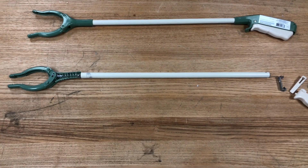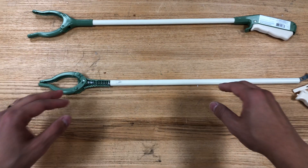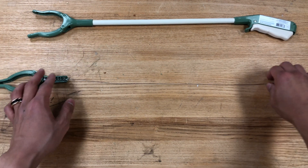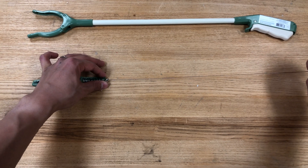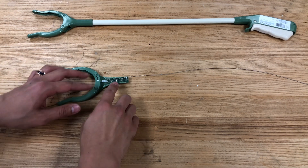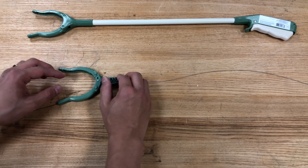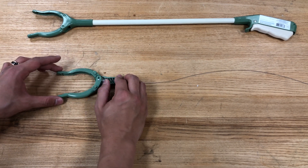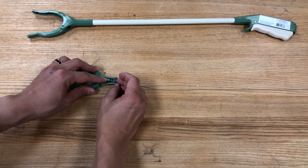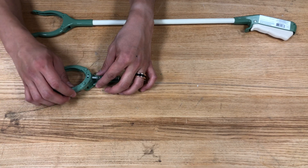I tried to restore as much as I could after disassembling and dissecting it. So inside the pipe, what it really is, is a very simple metal wire that's able to pull the string. When the gripper is open like this, there is a mechanical spring that puts the gripper back to its original position. Once it's pulled with the linkage system, there is a spring that holds the position, and this movement is governed through the linkage hole that you see here.